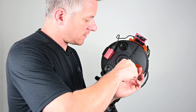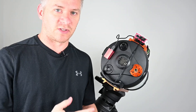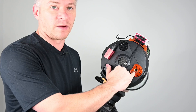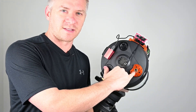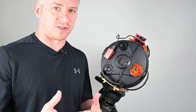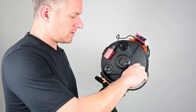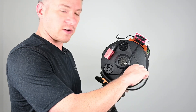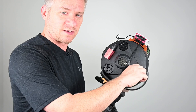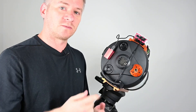Now, once that's all done, you don't want to over-tighten those screws, because then the plate might rest against the focus bearing and it's going to be very tight to turn. So once you've done up those screws and it's well centered, just turn the focuser and make sure it's not sticking - that it's turning smoothly. Once that's done, we'll get on to the next step.